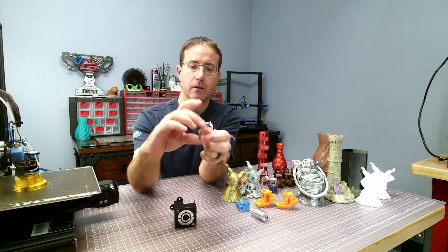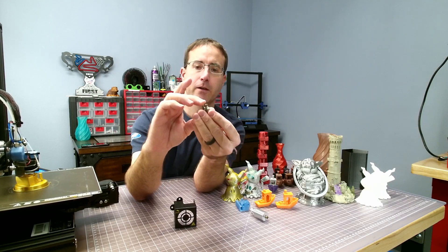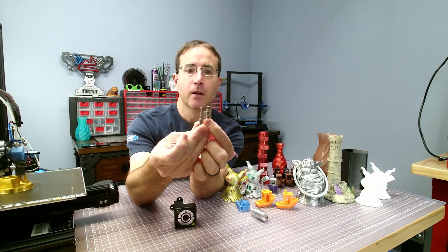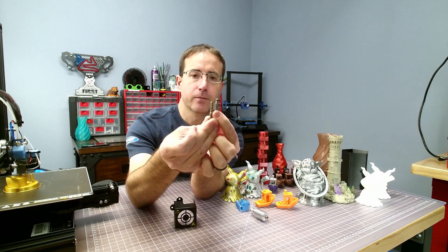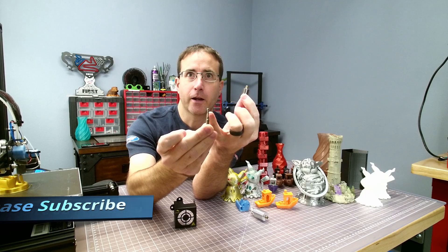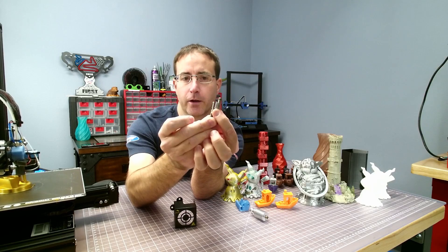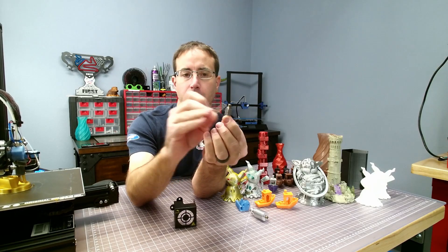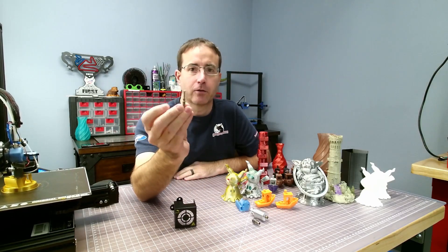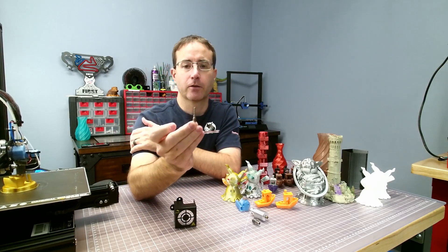Here's the nozzle — it's so small. The nozzle goes way up into the heat sink itself, and you can see how it's been designed with the heat break and these extra ribs on it. On the production unit there are actually some holes in there to help further cool the heat break and nozzle.